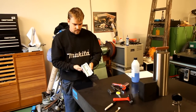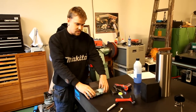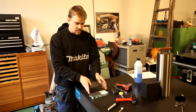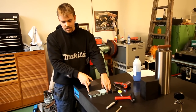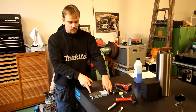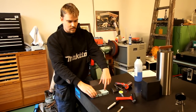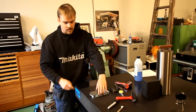And here you can see the bluing transfer. After you have blued, you always hinge your part on the table, and it should hinge about 30% in from each end. Here we can see it's hinging right at this corner, so it's a bit high here. The other side hinges in the middle, about 30% in. So that side is good, but we got a high spot here.